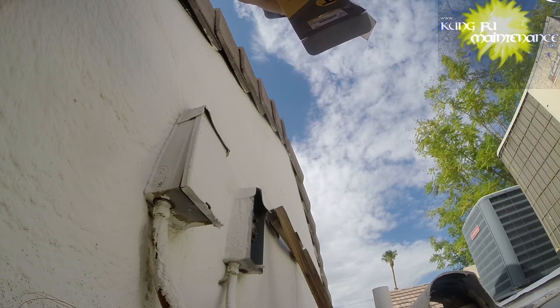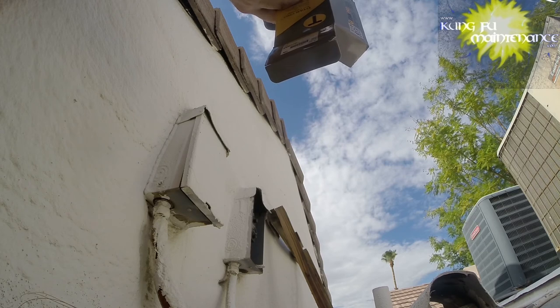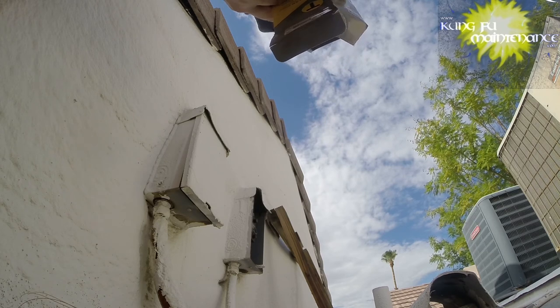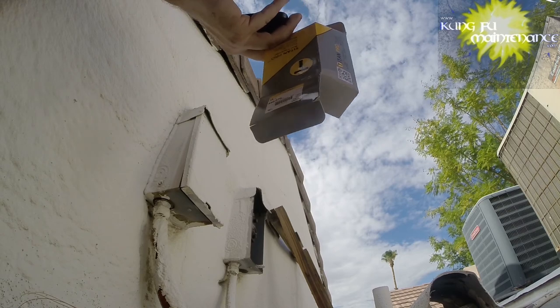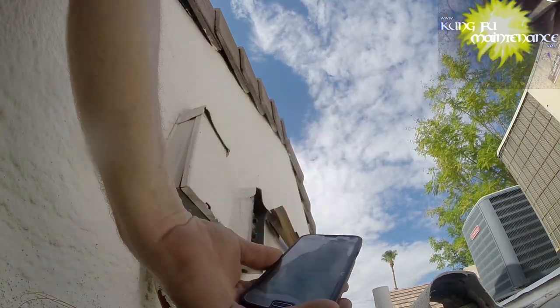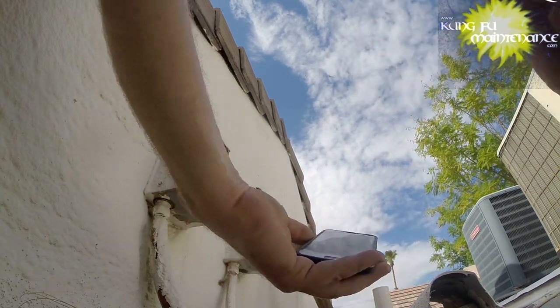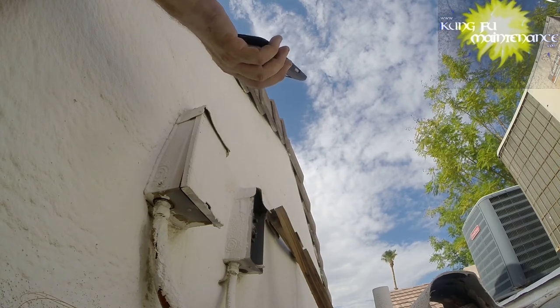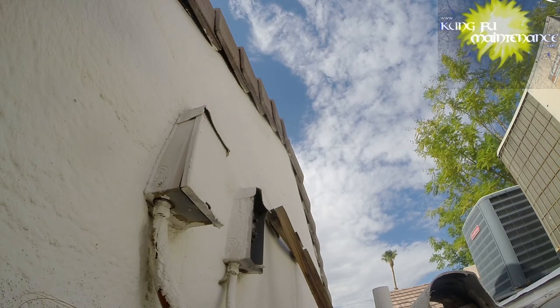Calculator. Clear. We're gonna go 0.62 times 2650 divided by, that one was 350 volts, equals 4.69. So 4.75 would be good, but my calculations weren't perfect. I kind of rounded off to the nearest number. We were close enough, suffice it to say.